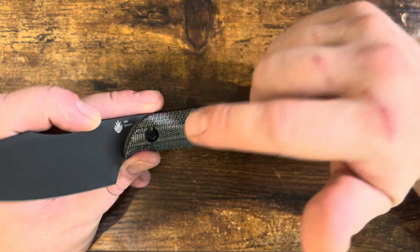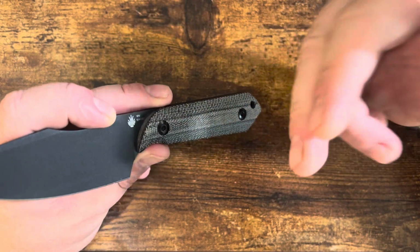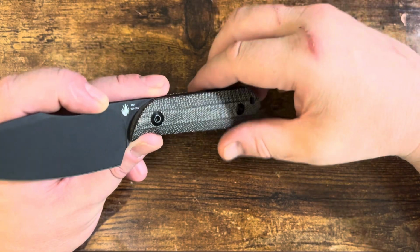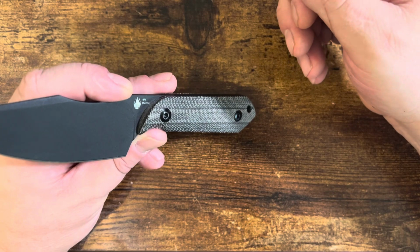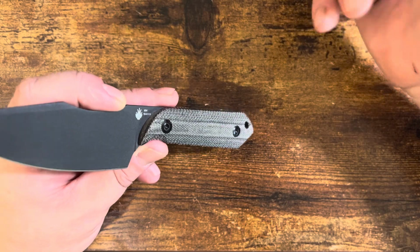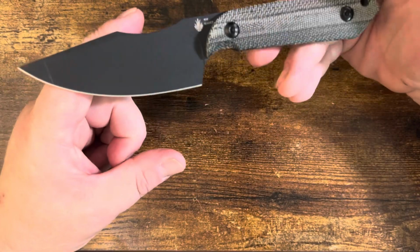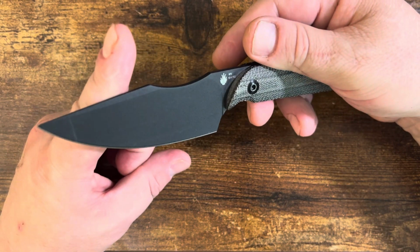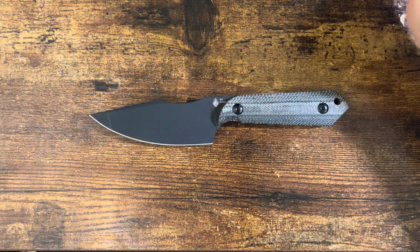They're coming back around with some D2 steel. Again, not the same as the 10V. All of the same stuff applies, but the noteworthy point is just that it's a good EDC knife. D2 has a lot of the same qualities as 10V, just 10V has more of it. Just more of everything that is great about D2. D2 is only like 1 to 1.5% vanadium, so you're talking like 10 times the vanadium approximately. And about half the chromium or so.